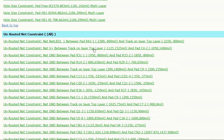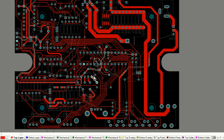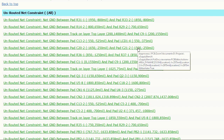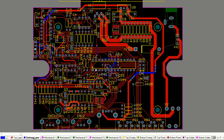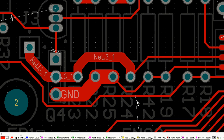I've done another design rule check. I'm looking through the errors. There might typically be a whole bunch of errors for silkscreen spacing and things like that, but I'm not too concerned with stuff like that. It looks like I've just had a couple of breaks in my power rails there, and it's told me that I might have 5 unrouted power nets or something like that. So I'm just tidying those up, adding in the 3.3 and 5 volt rail nets.